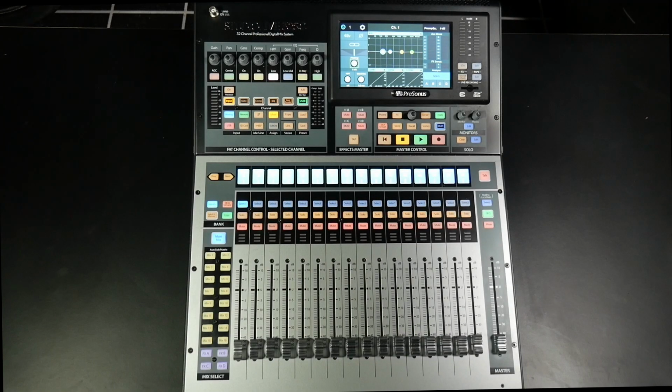So this forces the mixer to load the factory firmware image and erases the current firmware version from the mixer. This method does not erase or affect any of your user data like scenes or presets. This will only reset your mixer to its factory firmware version.